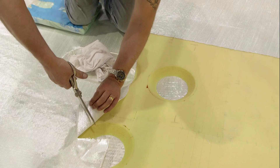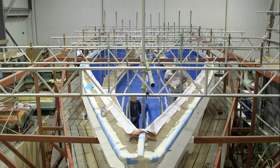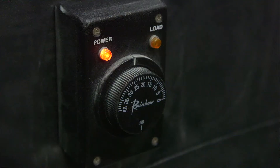Sandwiched within the glass is a layer of high density core cell foam. All of these layers are then sealed inside an enormous vacuum bag, connected by a network of pipes and channels to a large resin tank warmed by a heat jacket.